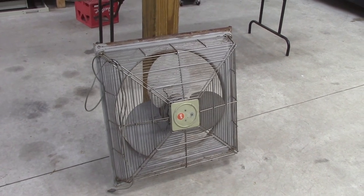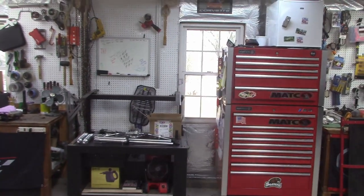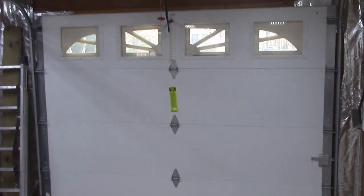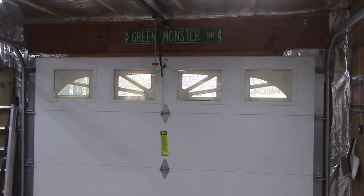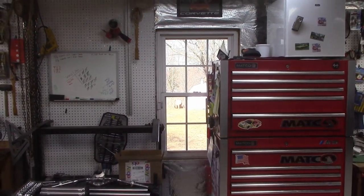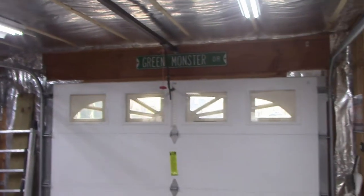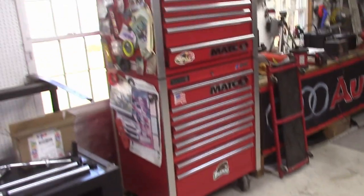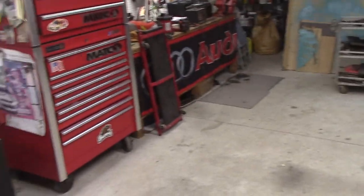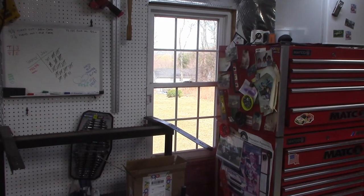Nine years later I think I finally have a use for it. Here's the middle bay of a three-car garage — I've got a window in the back and the garage door over here in the front. My idea is to drop the top panel of the door to draw in some air and put the fan in the back window as an exhaust fan. Air will blow out there, drawing in from up top, and I can do my painting close to the window so all the overspray will go right out.